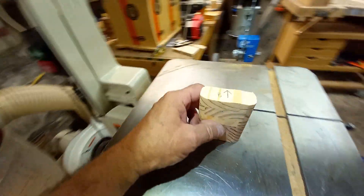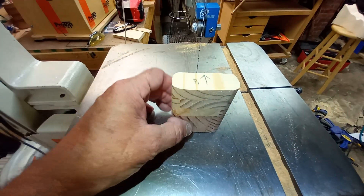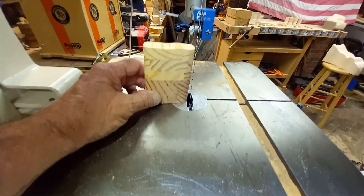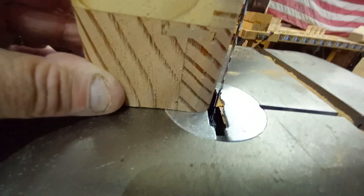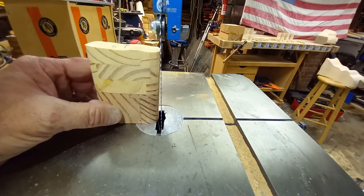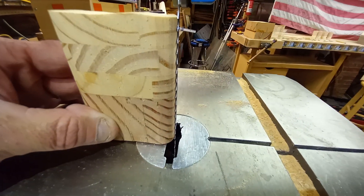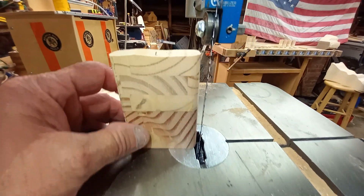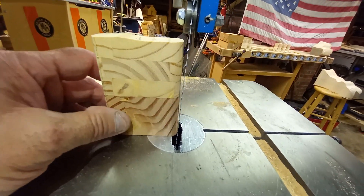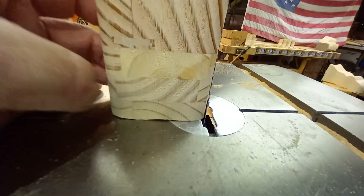When you come over to cut you're going to want to trace out where you're going to cut the carcass — the piece of waste out. Then take your block and come up against your fence. You can see the issue: there's space at the bottom and no space at the top. The tip is to adjust the table so that when you're cutting, you're cutting straight up and down. I've had too many cases where I go to cut something and it comes out at a drastic angle.